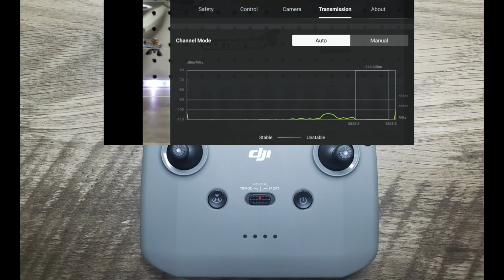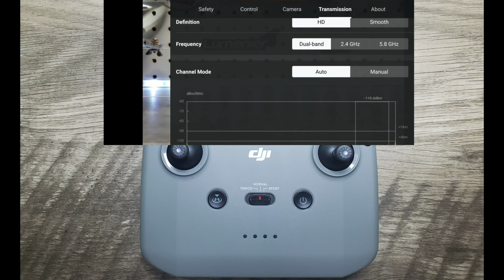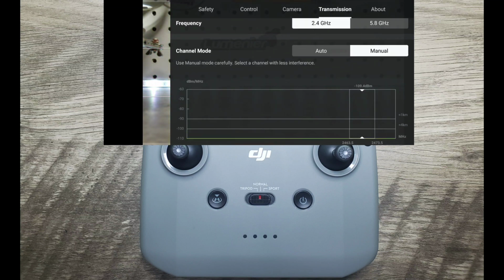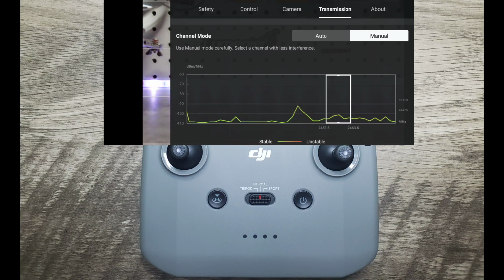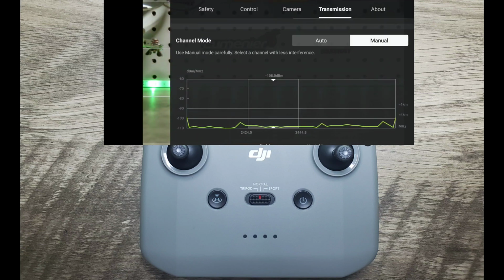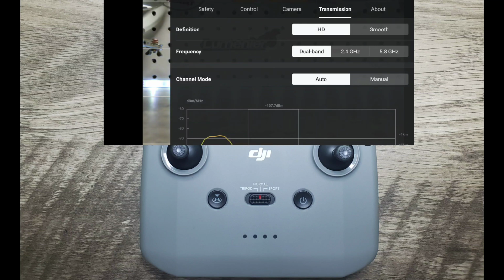And you'll see here we have a stable versus unstable. But if you set it to dual band, it's going to use both to get you the optimum frequency for your control link. And then we have our channel mode set to auto. You can do it manually by pushing the manual button, and then you can just scroll this over and check the best stable channel you would like. So as you can go right here, and you can just lock in whatever channel you like the best. I put mine to auto because auto is always going to be looking for the best signal, so it will constantly keep moving to give you the best channel. I think that's pretty much going to be the best setting for most. And that's pretty much it for the transmission tab.